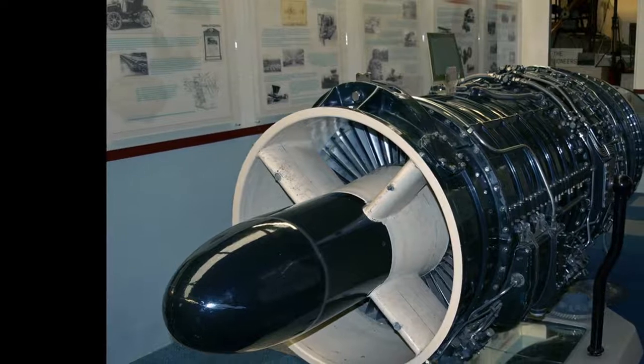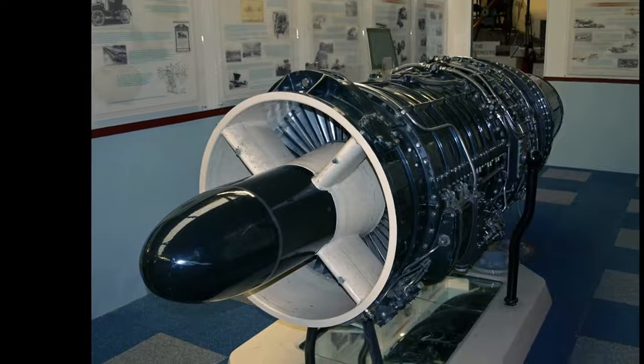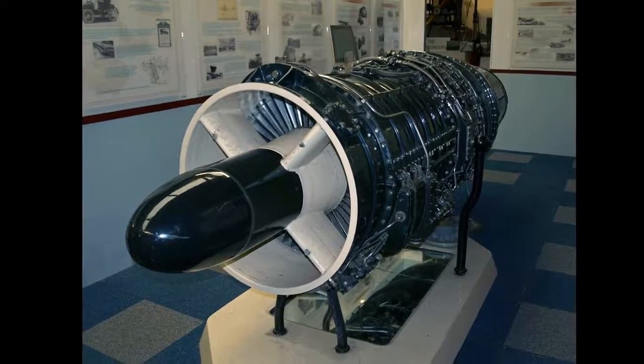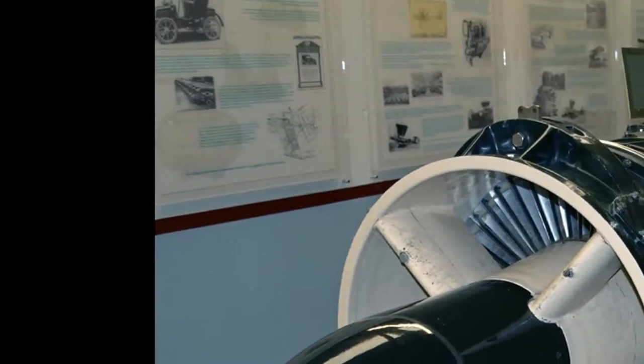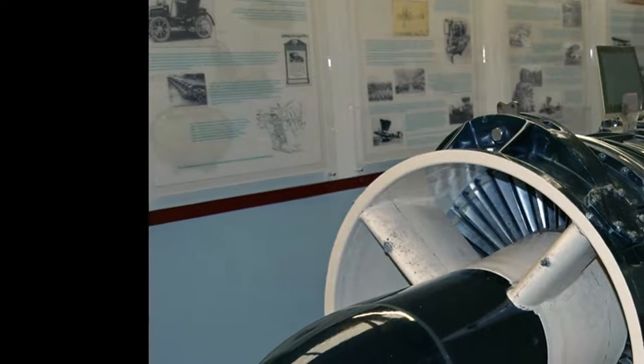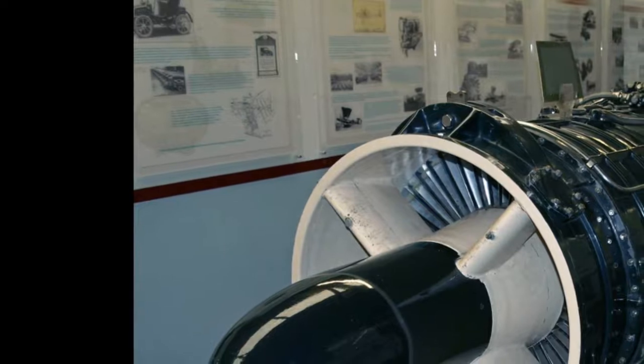The Sapphire compressor operated well, free from surging, over its complete RPM range without the need for variable inlet guide vanes (VIGV) or bleed. However, early compressor stages suffered from fatigue due to rotating stall at low RPM, and various fixes such as lacing wire were incorporated. Curtiss-Wright introduced variable ramps on the Wright J65 at the entry to the compressor to prevent stalling and blade excitation. Armstrong Siddeley tested a similar solution on the Sapphire but incorporated blade changes instead to reduce the blade response to the stalling.